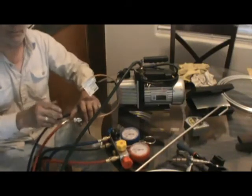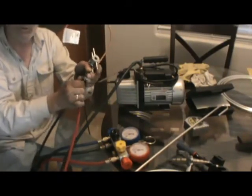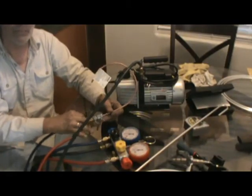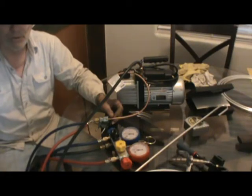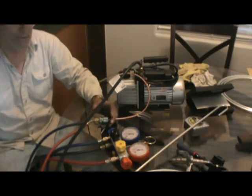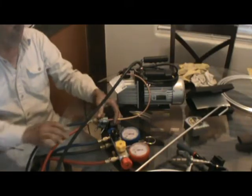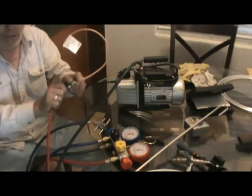That's one of the biggest problems with people when they do this, is they'll have a hose loose. And it just starts leaking, and it's like, oh my God, I've got a leak in the solder joint. And then they go back and start messing with the solder joints, and there's no leak. It was the hose that was loose. Okay, so be 2 and 3 times check your hoses and make sure there's no leak. That you have the hoses tight. Okay, I've done it myself. It's really common. Even when you're moving the tubing around and stuff, sometimes it can become loose. So get it really good and tight.